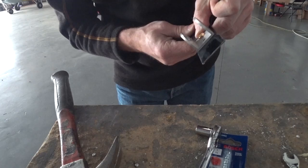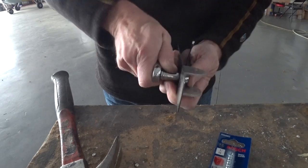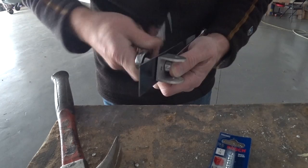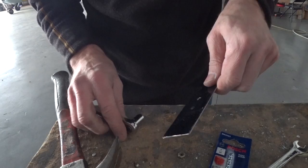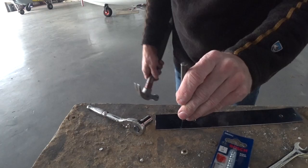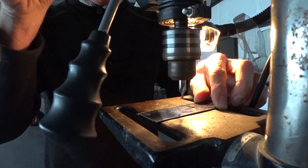Welcome back. I decided I was going to drill that second hole in the trim spring steel. As you can see, I've taken it off the aircraft and just used the little transfer punch in the secondary hole on that bracket to put a mark where I need to drill. Because that spring steel is so tough, I then used the regular center punch to make that dent a little deeper. And there lying on the table by my hand, I bought a carbide bit - one of those ones for doing masonry work - which is what people had suggested, I think even Britt suggested I try that.